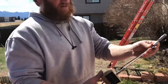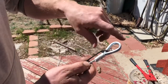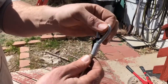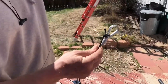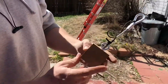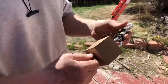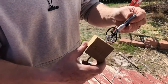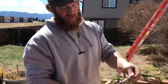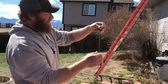This is the house side — the side that attaches to the house. When you buy cable from the hardware store, typically one end will come with a ferrule clamp and a thimble. You can use that to attach to the house or your upper end of the system. I've attached a block of wood and an eye bolt here to cushion the blow from the pipe as it slides up the cable and protect this part of the connection. I had some springs and washers, so the theory is it absorbs a little bit of that shock. This part attaches to the house.